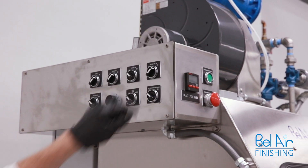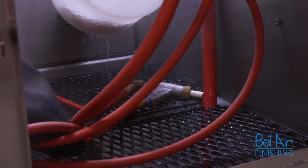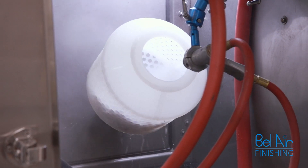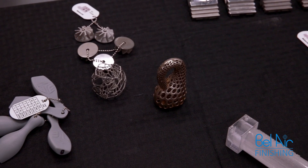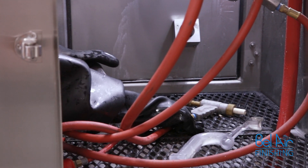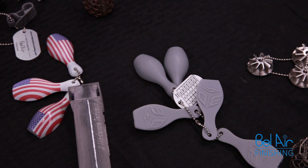The unit operates hands-free and is completely automated with a rotating basket and multiple fixed blasting guns, with a fully controllable, high-pressurized slurry that can deliver various degrees of finishing. Entire builds can be automatically post-processed at one time. The water jet offers a manual mode option where it can be used to clean and improve surface roughness in hard to reach spots due to complex geometries of your additive manufactured product.